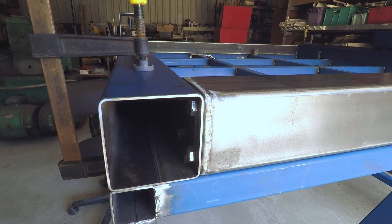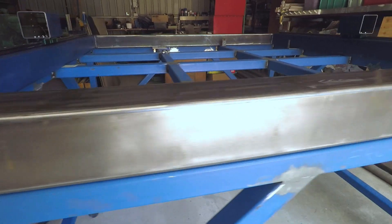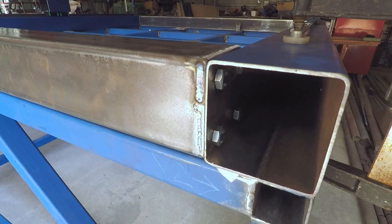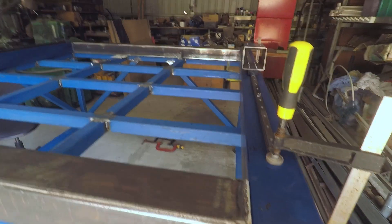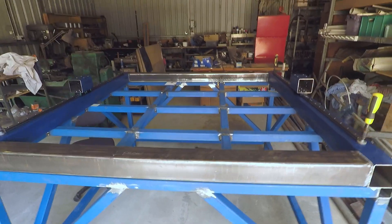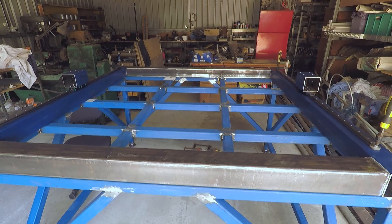I've now welded the plates to the cross members and bolted them in. I've just got to put spring washers under these bolts, and as you can see it fits quite flush. I've done the diagonals again and I've got one millimetre difference on the diagonals over 2547 mils. I think one mil's not going to be too much of an issue with being square.